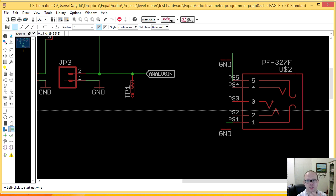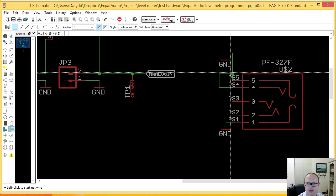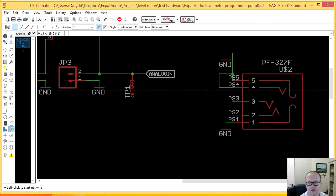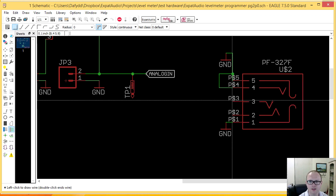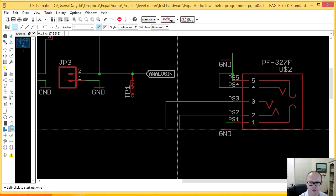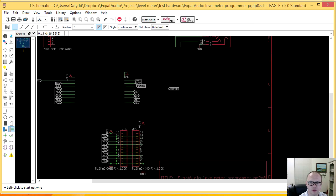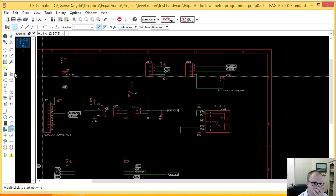I'm also going to connect the microphone, or the second ring. So typically you get tip, ring, shield. I've just connected the second ring to ground, and then these two need to connect through some summing resistors. So let's grab those. Do I have any other resistors on this board? No, I've been terribly efficient. Okay, so let's add a resistor.